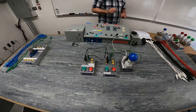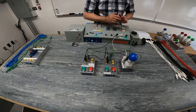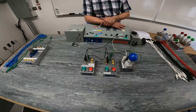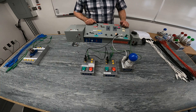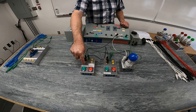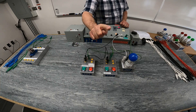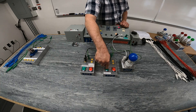We want to see the result of connecting two normally open push buttons to a light on a 120 volt power supply. We're not using any relays just yet, just looking at the functionality of push buttons. I'm going to power this up — right now our light is not energized. What happens if I hit the first normally open button? Nothing. What about the second? Nothing at all.